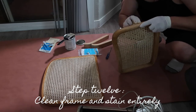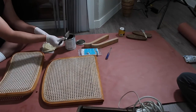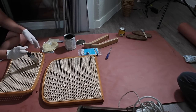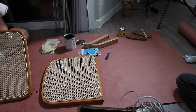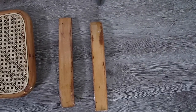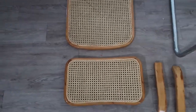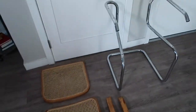The next day the glue was all dry and ready to go. Using a cloth we took off any excess dirt or dust to prepare them to be stained. I used a classic oak stain from Lowe's — I believe it's both the stain and satin finish all in one — and it was really easy to go straight across, getting as close as possible to the color of the frame. I think these came out so clean and pretty. Not perfect because we are not professionals — for example, we couldn't take off the previous stain on a little edge, so it just over-stained and made it darker — but other than that they look so crisp, shiny, and beautiful. Honestly it looks more expensive than the one I already have, and it's the one I found in the trash.